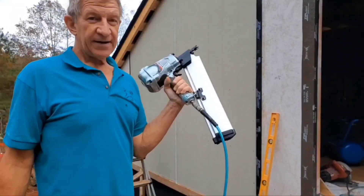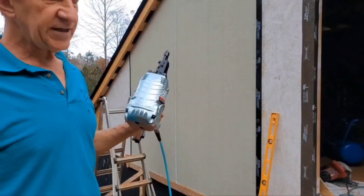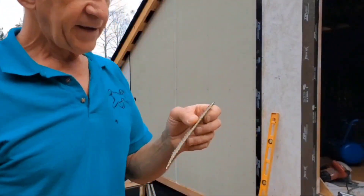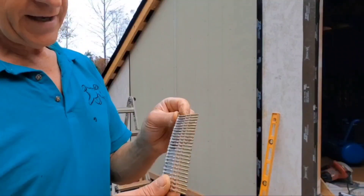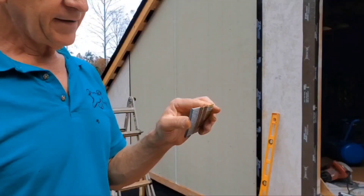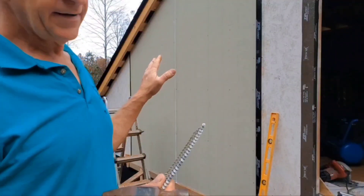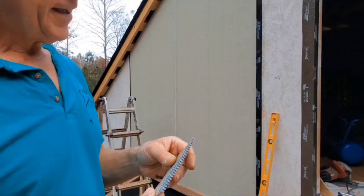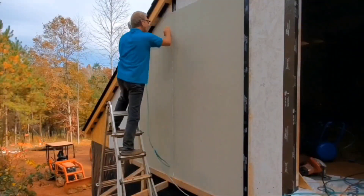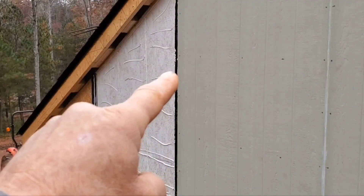I'm using a framing nailer and not a siding nailer. They're not horizontal slats, so for a four by eight sheet I felt the framing nailer was fine. I used small nails — not big diameter — they're ring shank and a little over two inches long. I did some tests on some boards and they seem to do a nice job. They've got enough head surface to hold, plus they're glued on there, so I don't feel like it's going anywhere.